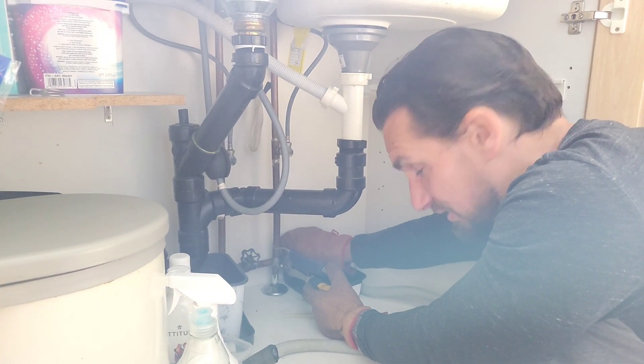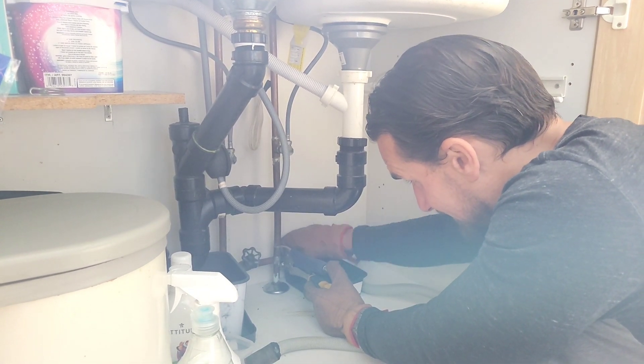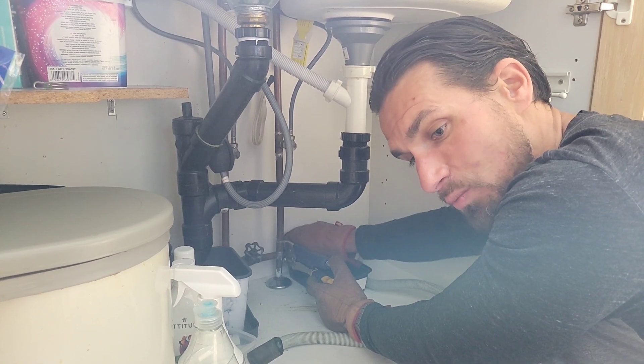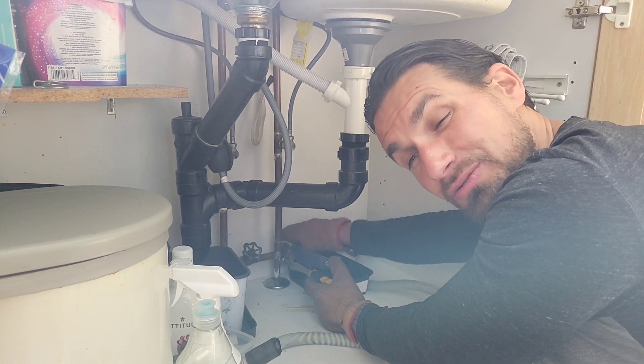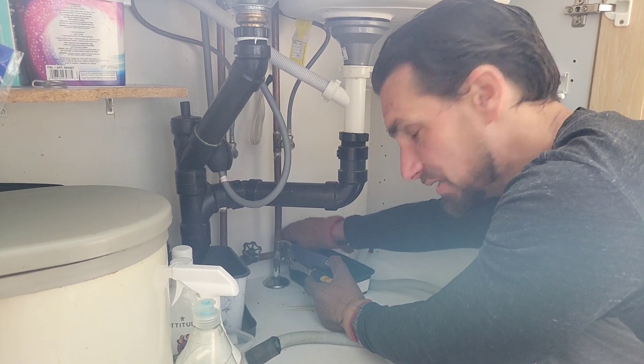Once we get that off — I've secured there are no vibrations going to the main piping — I can do the last little bit with my hands and then the piping will slide out. By then we should be ready to pull the dishwasher out, but there are some screws usually above the dishwasher screwing into your countertop, so we'll just have to do those by hand.